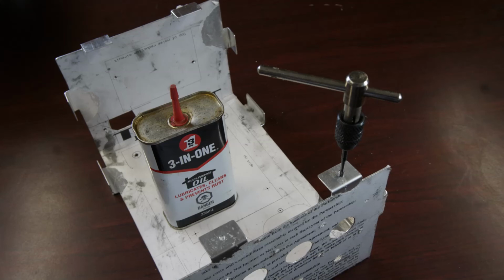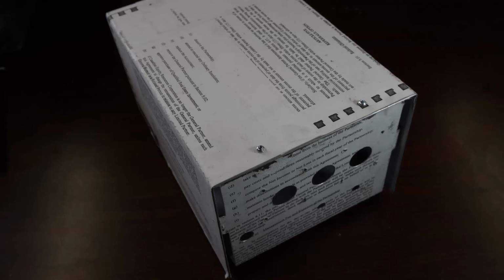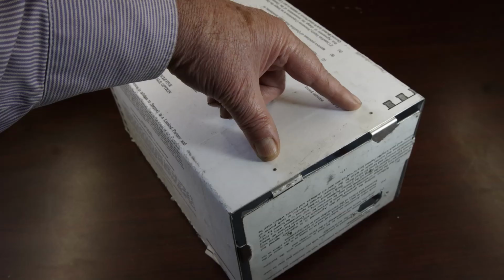Once the holes have been enlarged and the inner ones tapped, the cover can be screwed to the top of the front panel. Then turn the unit around and process the 2 holes along the top edge of the rear panel. Note that these 2 tabs extend a little bit beyond the cover when the base is not being held in place. That's simply because the bends weren't quite 90 degrees. And this is the reason why I drill the attachment holes in separate groups.